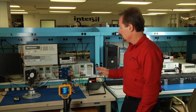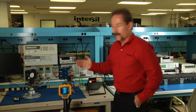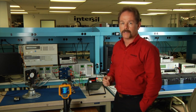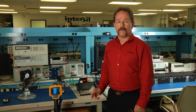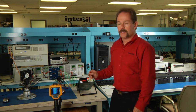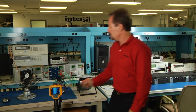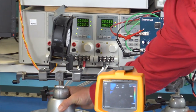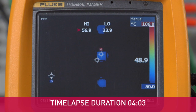Very efficient. So under these conditions, you don't need a heat sink, you don't need air flow, and yet we achieve a very low overall system temperature operating level. If you do have a system operating at extended temperatures in a hot environment and you do have air flow available, you can see that there's going to be significant improvement in overall thermal performance. In this case, we'll take a fan calibrated for 200 LFM, apply air flow, and we'll see just how far down our temperature drops.